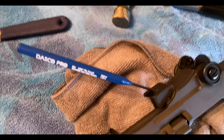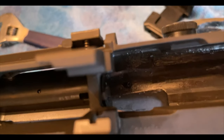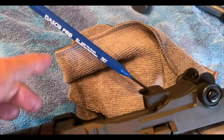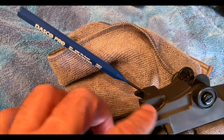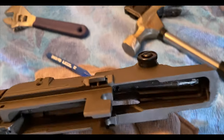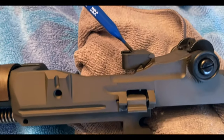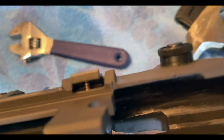Just so you know — my pin was incredibly stiff, and it's still not out. It took really delicate hammering. Be careful to use a microfiber or a soft head. This is a 3/32nd inch pin. If you look at the Springfield tutorial, he hits it once and it comes right out. I'll tell you, every one of them is going to be a little unique and more stiff. This one was incredibly stiff — I've been hammering away and it barely wanted to come out.